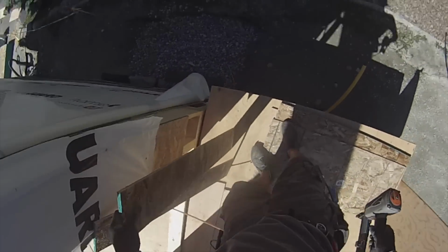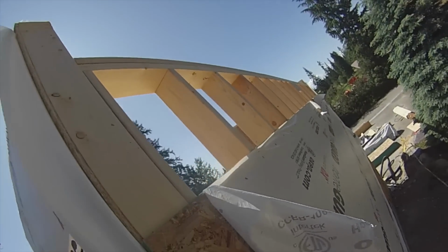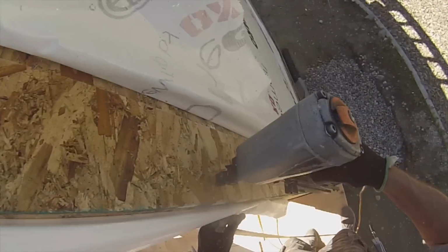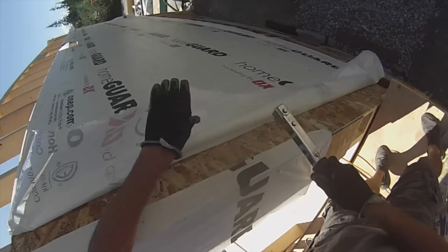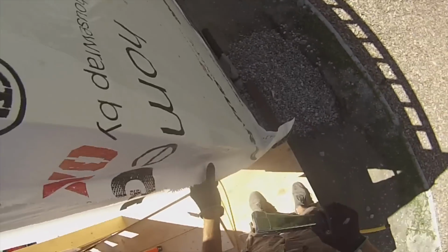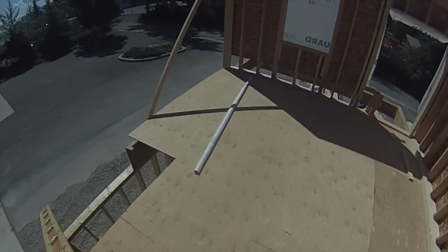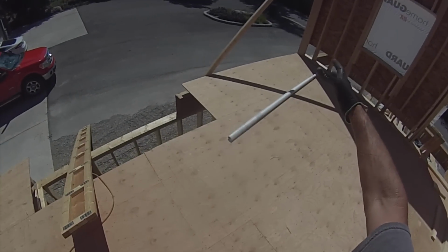Okay, so obviously I couldn't sheet right to the edge of the wall here. So that's what this is about. I got it halfway on the wall stud and out to here. So it's splitting the stud here. Okay, so we're going to wrap the paper around. Okay, we'll have to leave the rest of this loose. Okay, I think we're ready for this wall. I'm going to make a plate span that properly, and then I'll put 2 pieces of plate on the outside.